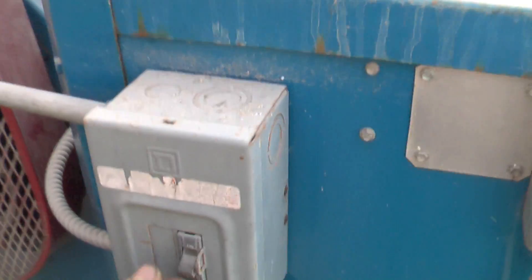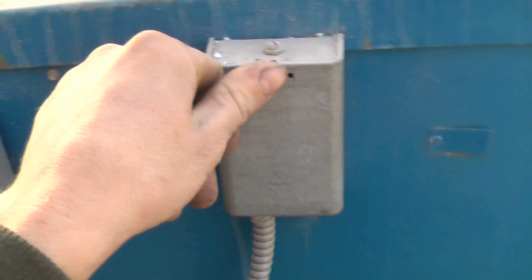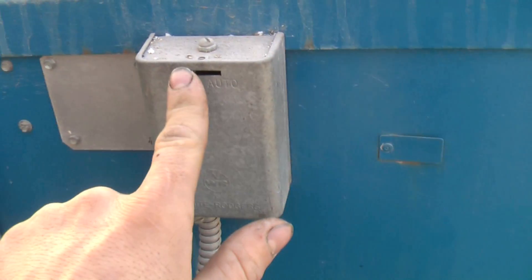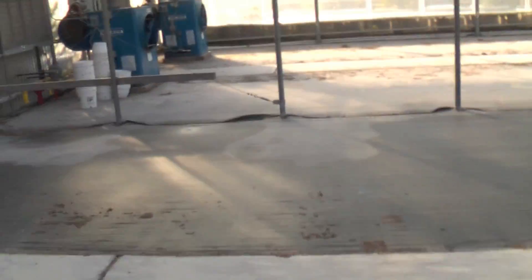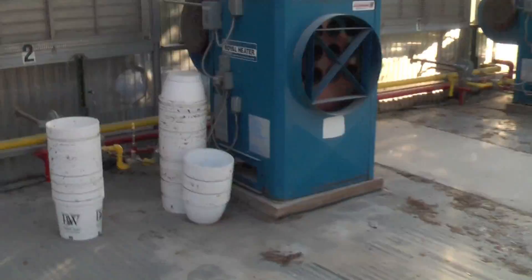It's just a little bit quieter out here. I'm going to turn these heaters on, put the main breaker on, and put the fan switch in manual. Then from the circuit breaker box close to the generator back there, as you saw, I'll be able to flip these on one by one and put a load on the generator and load test it a little bit.